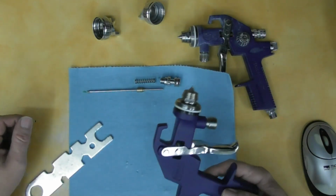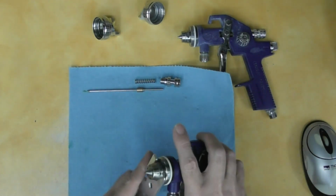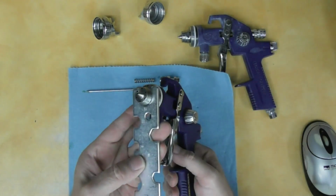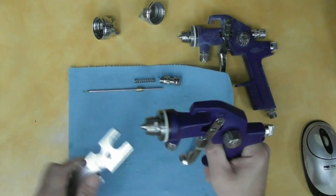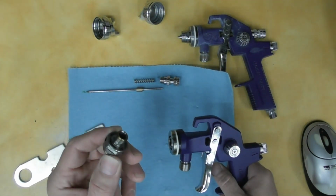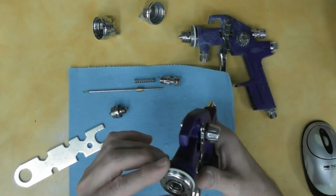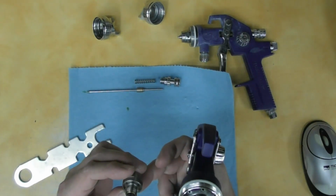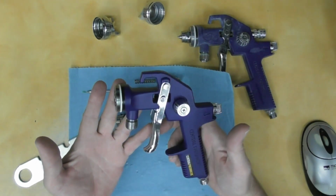Man, they had that thing on there. I wrapped a towel around here and stuck it in my vise and was able to get it loose. When you tighten these up, bring it up snug, get a hold of it like this, that's all you need. No sense in needing 200 foot-pounds to get that thing loose. That's how it should break loose right there. There shouldn't be any goop gluing this in. There's not, just some oil on the threads. Some dings on the front of that from something. Don't know, but that's as far as I take it down to do any cleaning for that matter.